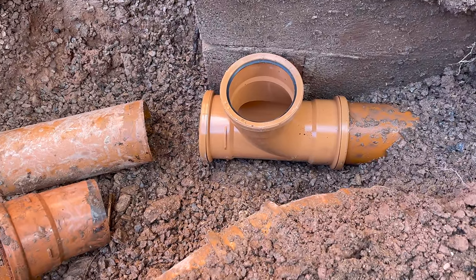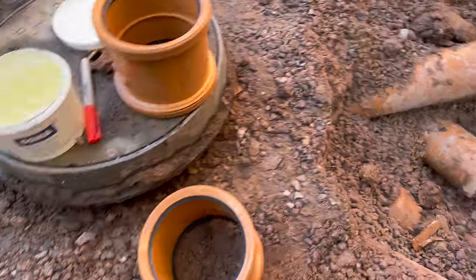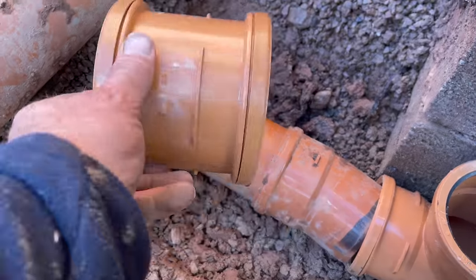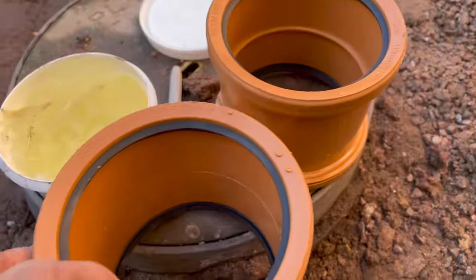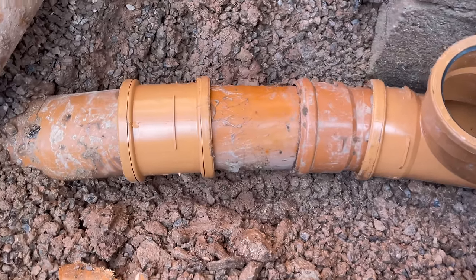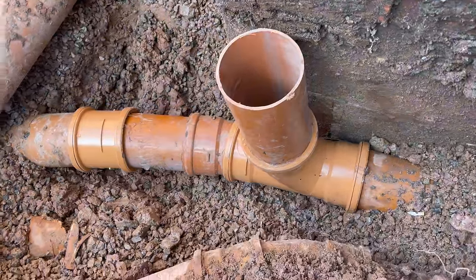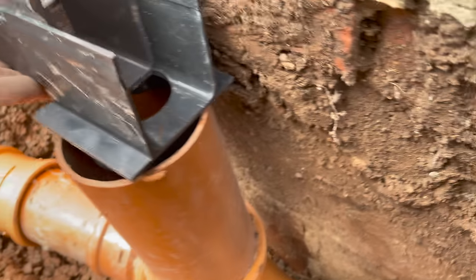Just bosh that one in. Now I've got to figure out this bit — I've got that one chopped ready. This next bit is the tricky bit. There's a special collar to use — see these two collars here: one's got a ridge and that one doesn't. This is the one we're going to be using because this allows me to put that on there and slide it over, put this pipe next to where it's got to be, then slide it over so it covers both of them. Two different types of collars, both look exactly the same, but one's got a ridge — we're using the one without the ridge. I just connected this up — that's where that's gonna go. Hey presto — just chopped a bit of pipe off, here's my connector going at this height, and then that goes over the hole. Finished.